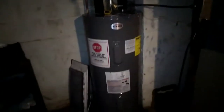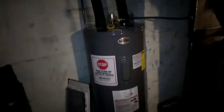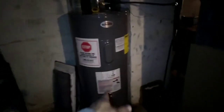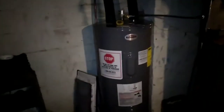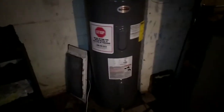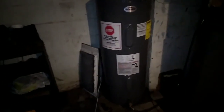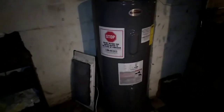This is going to work out really good with the DC elements, the one hardwired to solar panels, every day, all day. Every time the sun comes out, this will be warming water, a 600 watt element, and another 600 watt element as a dump load. And then also tying in the solar thermo circulation loop. We're going to be able to maintain 120 degree water year round.